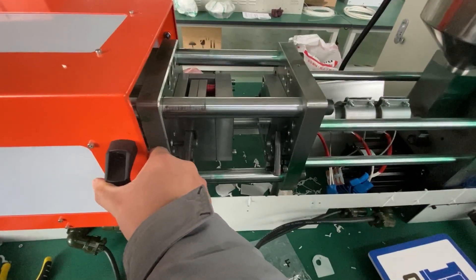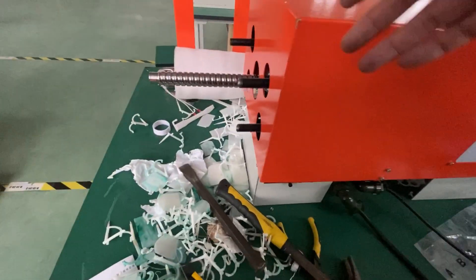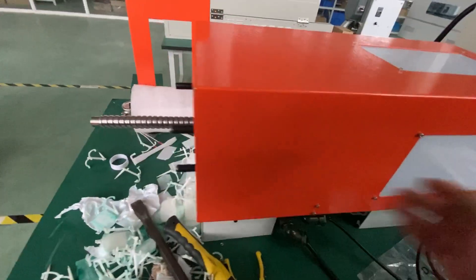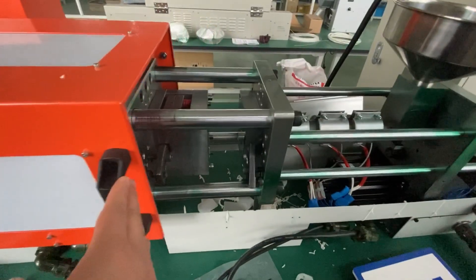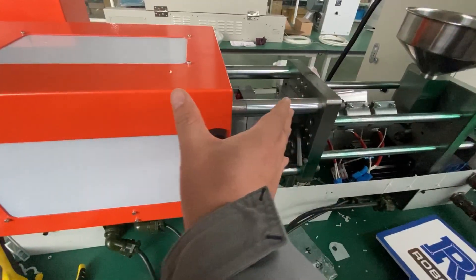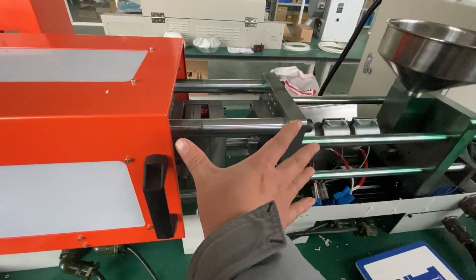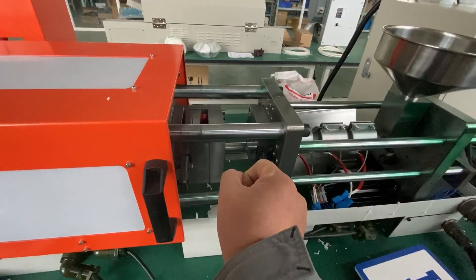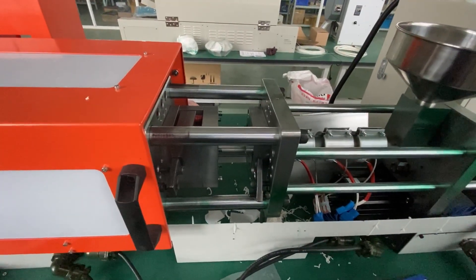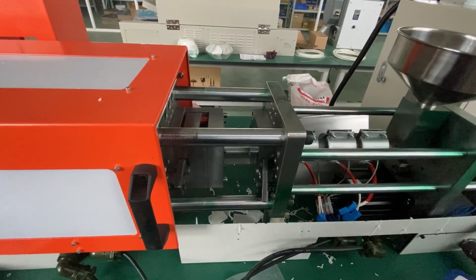To change the mold distance, as I mentioned, there are four screws here. If we screw them out a little, then the mold can be thicker. We just screw them a bit outward and then the mold can be thicker. Now let's check out another — the best seller injection mold machine and talk about the mold.